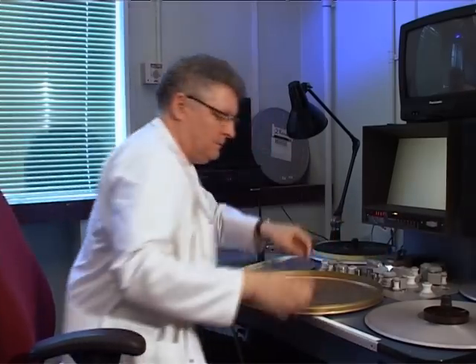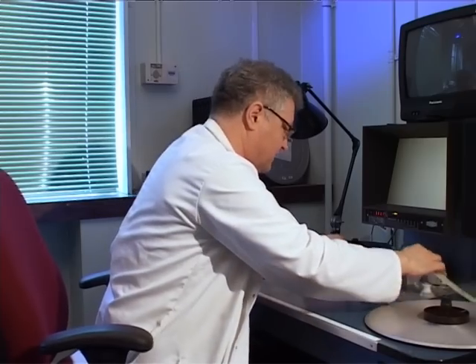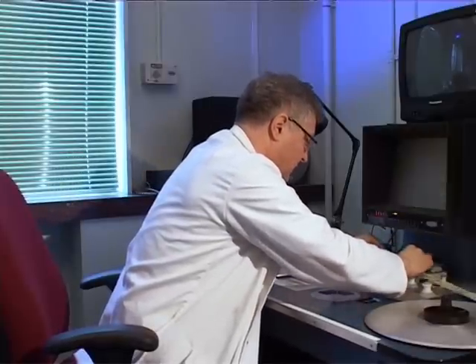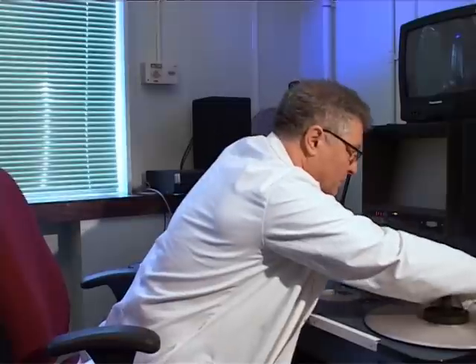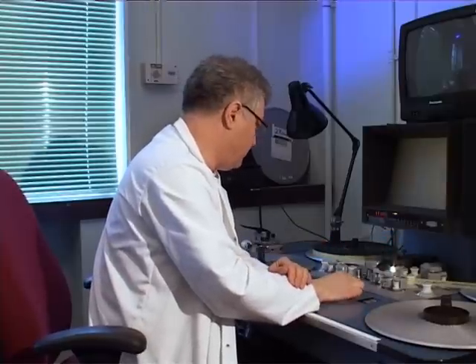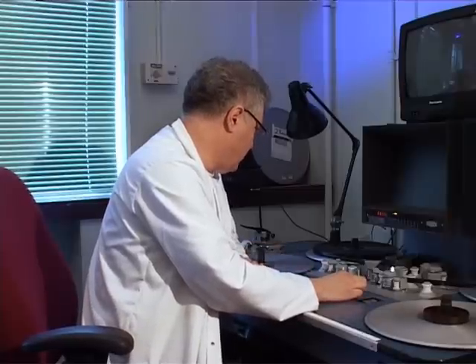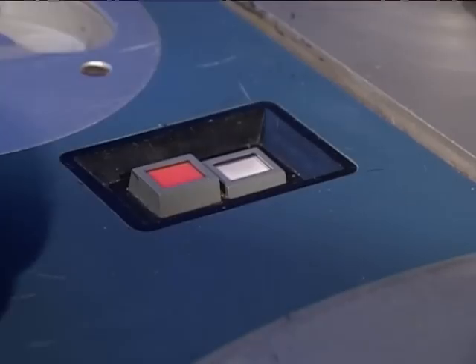Just in there. Notice that the print has perforations along the bottom edge, and we have sprockets which go into these perforations. This is a fairly simple operation with the print. The machine runs through onto a core on the other side, so now we're ready to run the print through to the gate. The gate is a cross symbol, and there it is. I'm going to put a brake on that and hold it there.